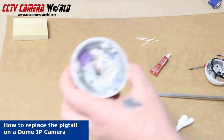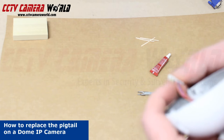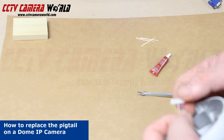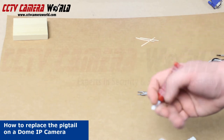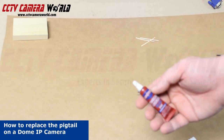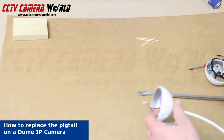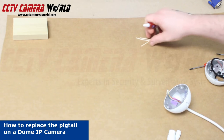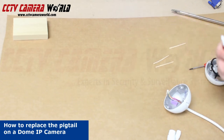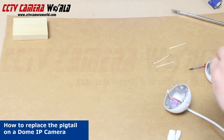After removing and replacing the pins, the connections could be loose. Make sure everything is in place tightly. To keep them from coming out of their homes, we're going to use a small amount of thread sealer. This thread sealer is Loctite — it's non-conductive. We have a disposable surface set up along with a tool to apply the compound. We're only going to use a small amount; it's not very viscous. You can apply it with whatever tool you'd like. We're choosing to use a toothpick today.